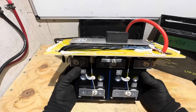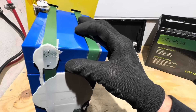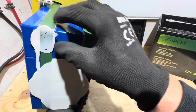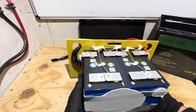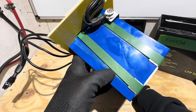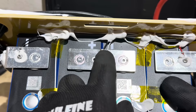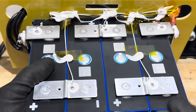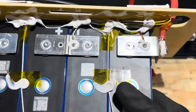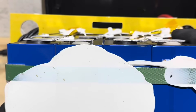Here is the cell pack assembly out of its case — got it out in one piece. It was glued down into the bottom. We've got tie-band compression around the cells and what looks like aluminum guards around the corners. Usually you see full-length plastic guards; they used metal pieces underneath the tie band here instead. The cells look to be in pretty good condition. There's a shot of the laser welds across the cell connectors and bus bars, and the balance leads are secured with machine screws and additional sealant on top. Decent wire management — tape holds down the balance leads with sealant on top. Terminal connections are super tight. We've got expansion joints between everything. Pretty uniform pack, no bulging.